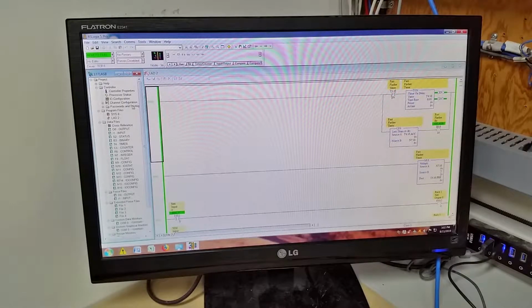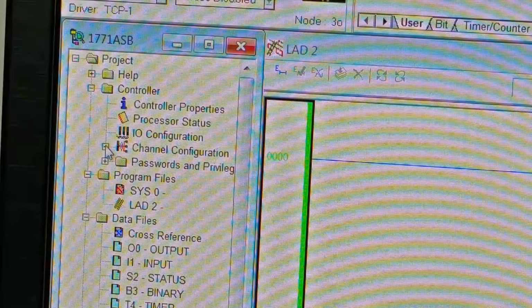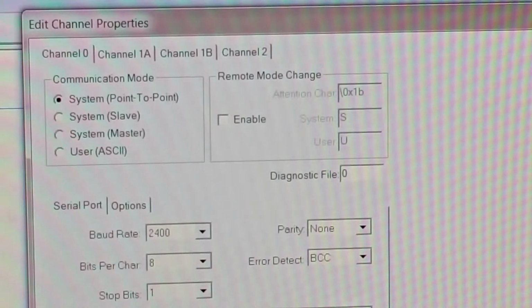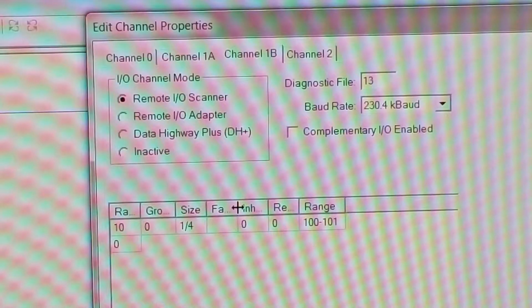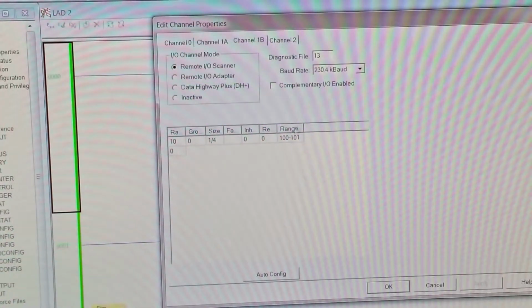Okay, so here we are back at the computer screen. So if we go into our channel configuration, which we zoom in and go right up there, channel configuration, a little plus there. RIO configuration is a different setup. Now if we look at our configuration and we swing back over here, we're using channel 1B as our communication to the remote RIO. And as you can see, we're set at rack 10, beginning group 0, and it's a quarter chassis. No faults. And you have to set the diagnostic file, or you can let it do it, and when you're in program mode, notice right down here, auto configure.